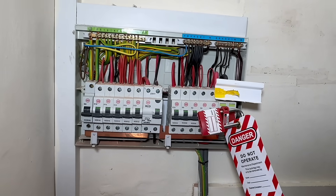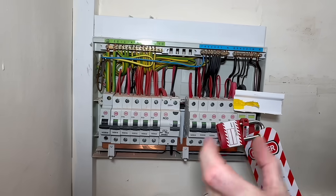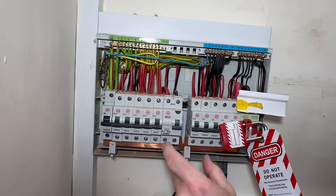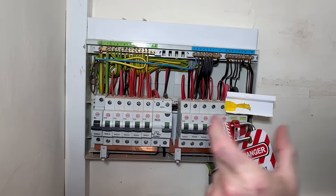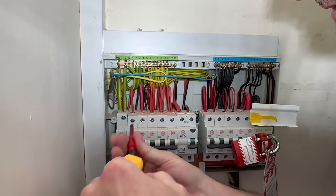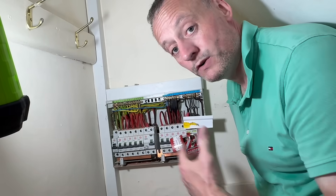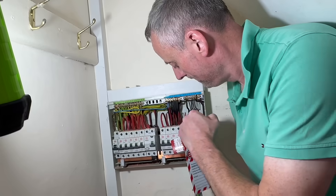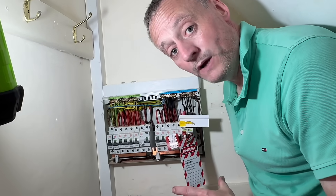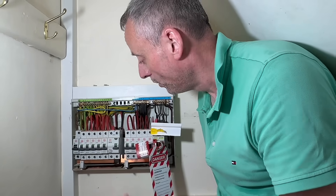I'm now looking for signs of thermal damage. Apart from the alarm circuit, nothing has been added as an additional load — no EV charger, no electric shower or other high-load items — so it's exactly the same as when it was first installed bar one circuit. I'd like to confirm the torque settings are correct before I put the final piece of the jigsaw together. I've backed off all the remaining screws and returned those to the required torque setting. The only two connections I can't do are line and neutral on top of the main switch because they're still live — I don't recommend having one hand behind your back for those. The tails are supported so they haven't been nudged or adjusted.